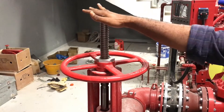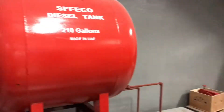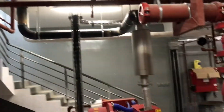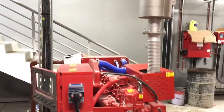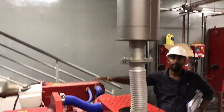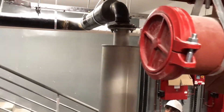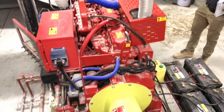This is a 2,210 gallon fuel tank which serves the diesel engine for the hydrant system. You can also see the diesel engine exhaust pipe. For this pump we have a 6-inch exhaust pipe, whereas for the other pump we have a 3-inch exhaust pipe. This is supposed to be insulated with lagging board to prevent heat and burst, and this line is already insulated.